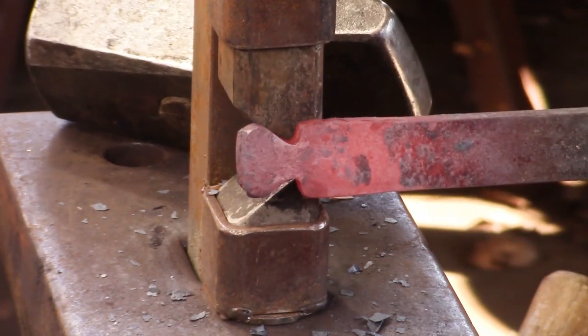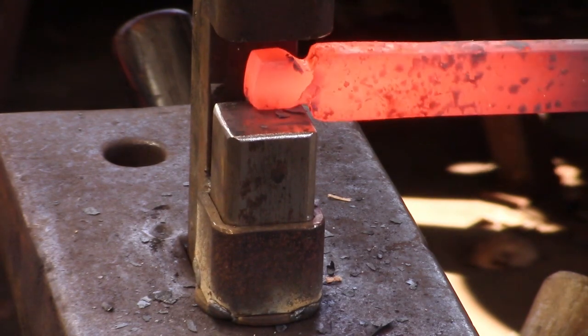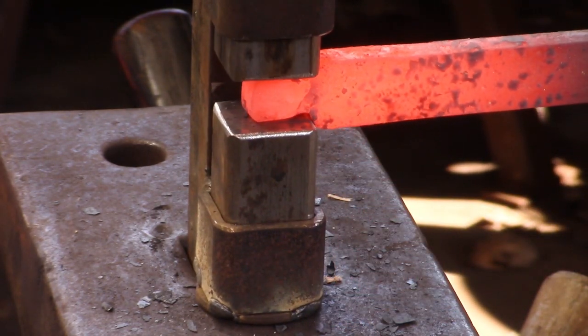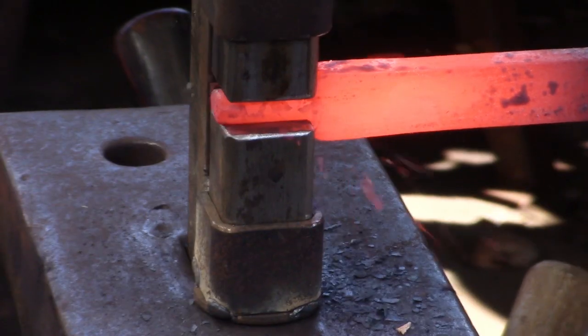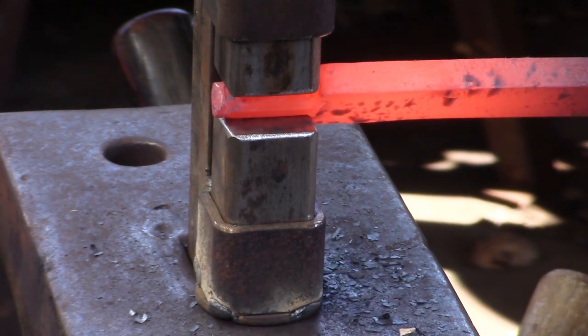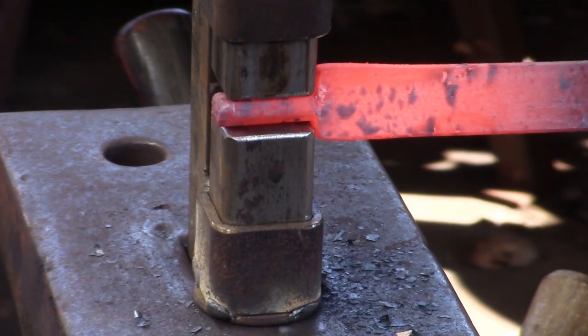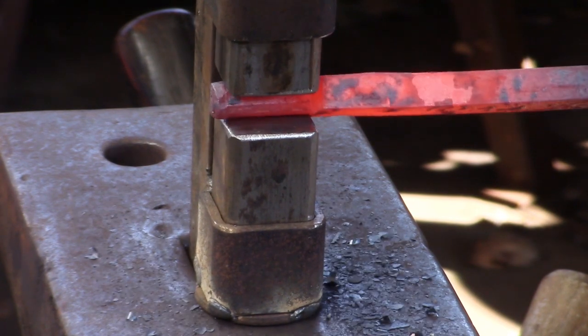Take it down to square section, 3/8 square, draw that out, so I've now got a 3/8 round tenon, and then I shrink that down to 5/16, so hopefully I'll get no evidence of the mortise when I fit this thing together. Although mine is going to be buried in those capitals and bases, so you're not going to see any of my mortise.